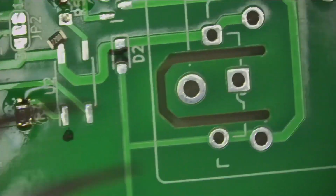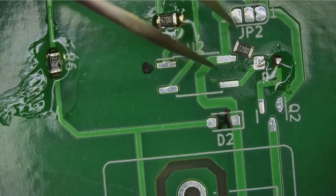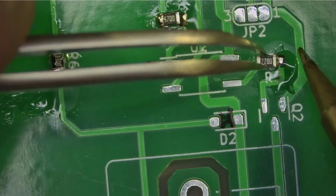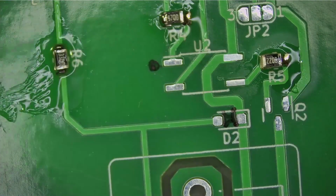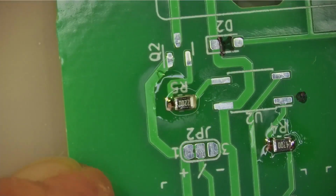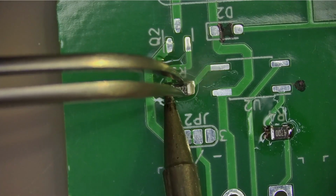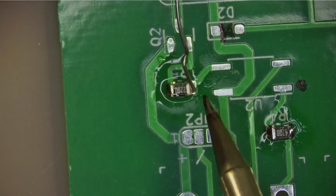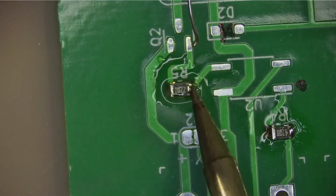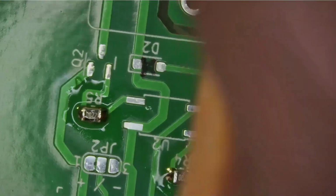The reason why we are doing one side first is that the other side can lay flat on the pad. Otherwise, if I put solder on both pads, it'll be raised in the air, and then I'd have to push it down, and sometimes when you do that, those little things snap away. I think I need to pull this one over a bit further. That's better. Need to have a little bit of pad there to put some solder on. Using my soldering station. It's sure nice to have some decent equipment to do that. Got it set for 333 Celsius.